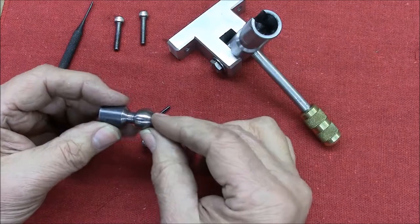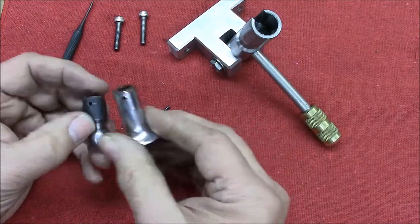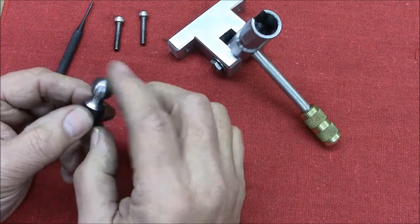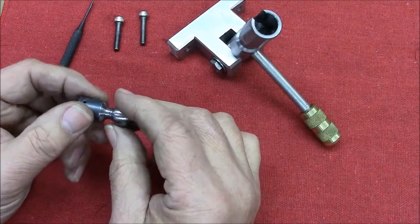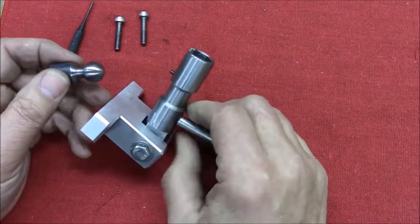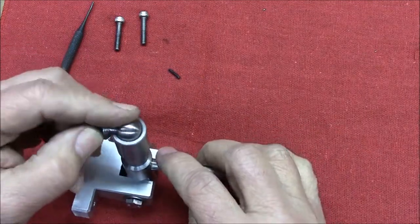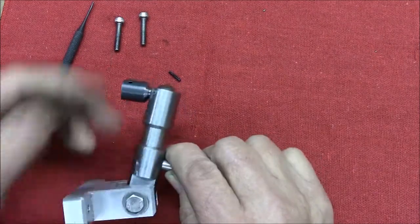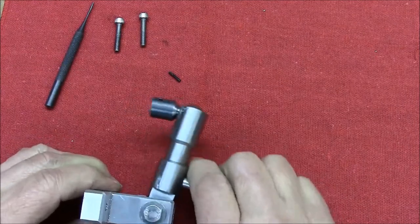The very first thing I did is I got a piece of hot rolled stock that I bored a 5/16-inch hole into, and a cross pin — the very same way this is done. Then I freehand turned a ball on here — that was my first freehand turning and it came out pretty good. What that allows me to do is insert the ball into this piece here — this is the handle. The ball slides down into a slot here, which allows the ball and shaft to turn, and also takes up the angle created when the shaft is not perpendicular with the cross slide lead screw.